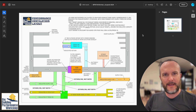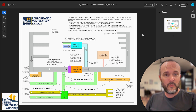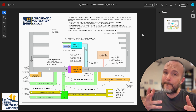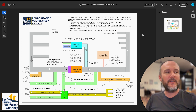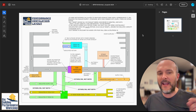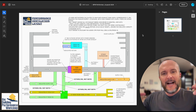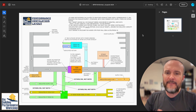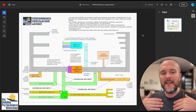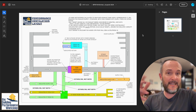In summertime, cold air generated by your air conditioner travels through the ductwork, cooling down the metal. If you're using pre-insulated flex duct that's properly taped, air from the attic can't reach the inside of the duct and you're okay. But for ductwork in an attic, you definitely want to insulate it. What we're really discussing is ductwork inside the conditioned space — do you still have to insulate it?